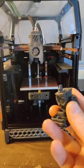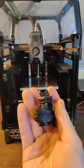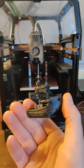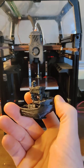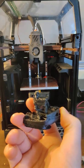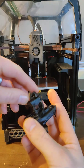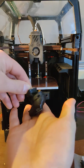But overall I'm actually very happy with this. I've had big issues before with extruding just enough plastic and I've since solved that problem. I have a Dragon high flow on here with a Mellow Volcano — I guess it's like a Volkanosk style. I went with an aluminum block because the thermal properties are basically as good as copper but about a third the weight, which is nice. I've actually reduced the weight of the entire hot end by about 12 grams compared to a stock Dragon high flow.